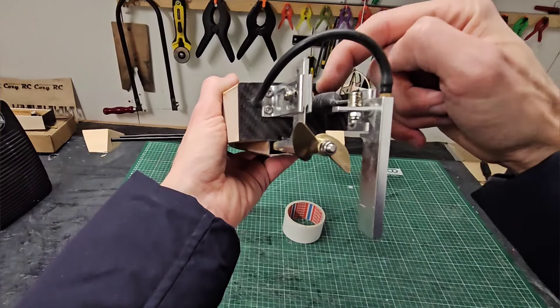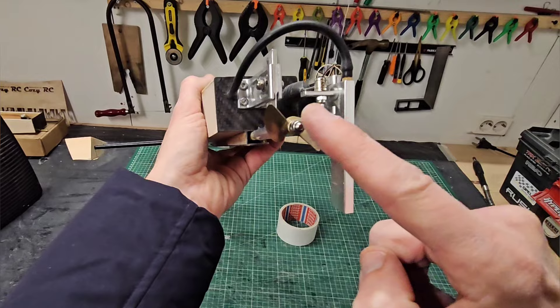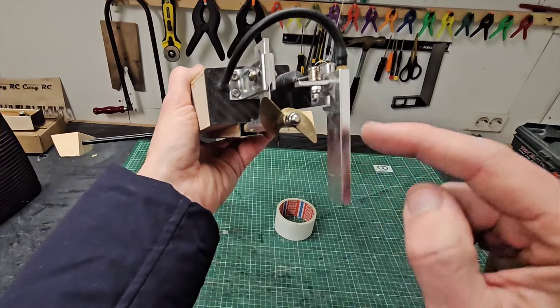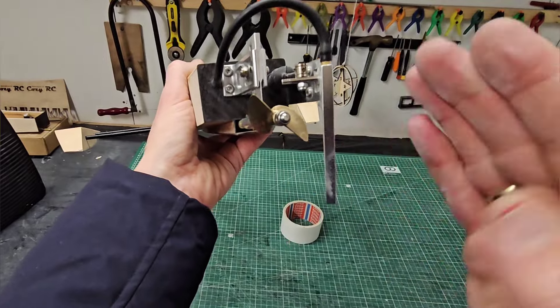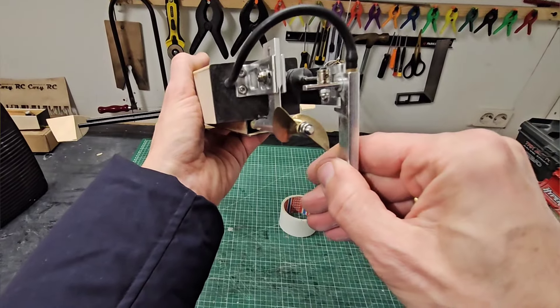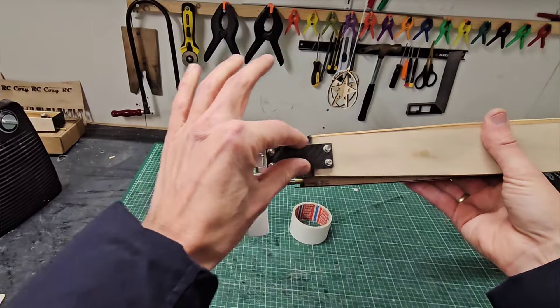The reason I put it here is because it has a little bit more room between the prop and the rudder. If you put the rudder on the transom or behind the transom, it will be very close to the prop, and if you run larger props they can almost collide, especially if it is steering left-right. So I also like the looks of this custom rudder arm.